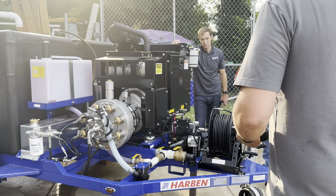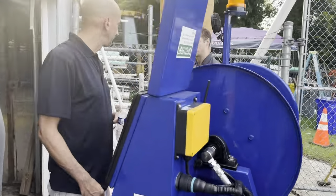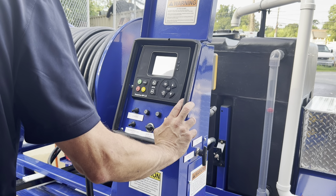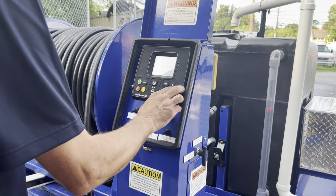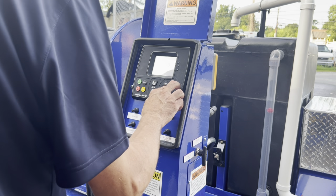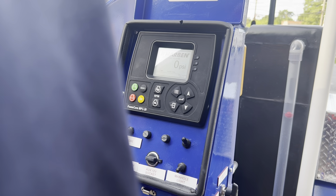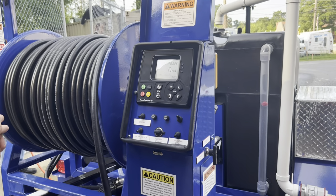You want to go over the control? Give it a shot. Sometimes we have trouble getting cameras to a certain length. I was thinking maybe you could attach a camera — zip tie it to the end of a hose — and use the jump jet to pull it along. I haven't seen that yet. A lot of guys who do relining do that. A jetter would definitely pull it along. Pretty easy.